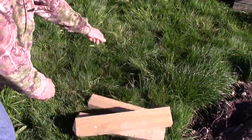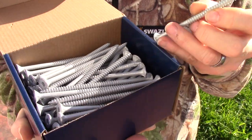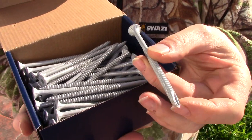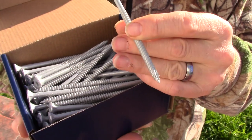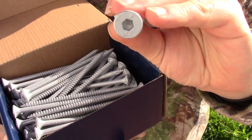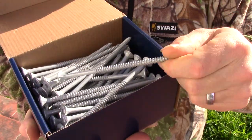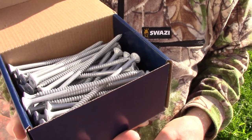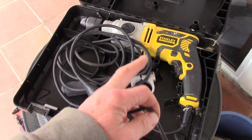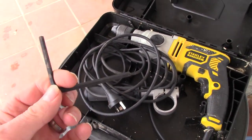To connect our 200 by 50mm bits of tongue and groove to our 100mm square posts, we are using these 125mm long bugle-headed batten screws — 14 gauge and galvanised for exterior use. To put it all together, you are going to need a very powerful torquey drill, because those purlin screws are hellish difficult to put in.